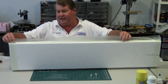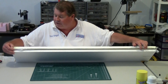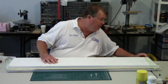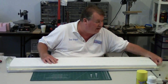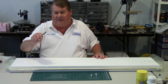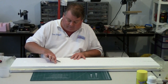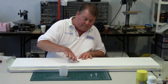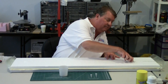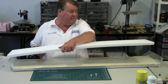You can see the porous release film sticking out. Unfortunately on this one I didn't have as much on the leading edge as I needed and my breather stuck to it. And that's the whole purpose of this porous release film — it makes getting the wing out of the shucks easy because some epoxy can come through the wood and stick to the shucks. So I use a pair of square nose pliers and pull the pins out, and you can see it's already popped loose.